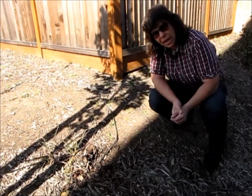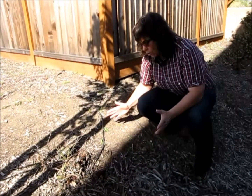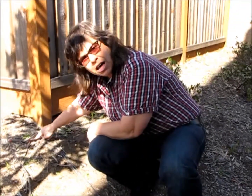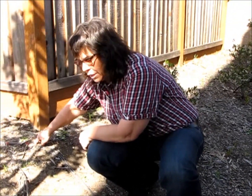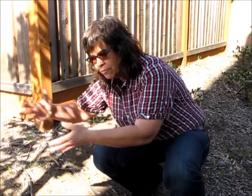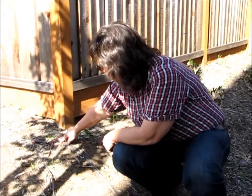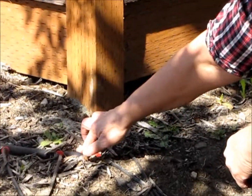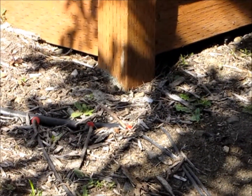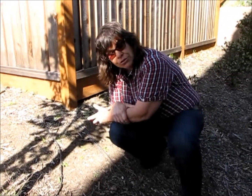A good way to design and build your drip system is to minimize the use of this 1/4-inch tubing. Try not to use a longer run than maybe 1 foot or 2 when you need to in a few situations. Instead, use a lot of this 1/2-inch tubing. It's very malleable. It comes with fittings, L's and T's. You can pretty much get the water very close to all of your plant material by using a lot of this 1/2-inch tubing. Then, when you get closer to the plant, it'll be similar to the example I showed you prior, where you put the button emitter right near the plant and you use no 1/4-inch tubing.